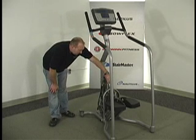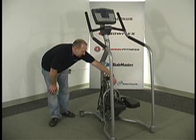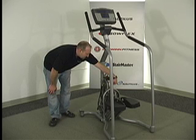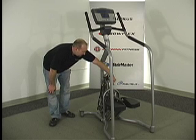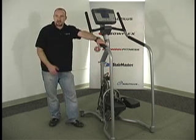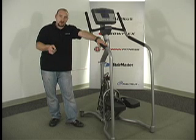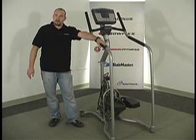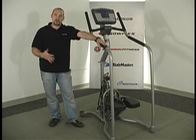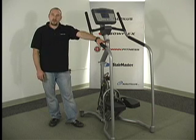The last thing to talk about is your alternator. You can test your alternator by taking off these connections on the back. This one is the B+, which is a white wire, and then we also have the field connection, which is a brown wire. As discussed in previous sections, all you need to do is the B+ to field test. You connect a jumper wire to each end and just start pedaling. It's as simple as that to rule out your alternator. Once you've gone through these components in this order, you should be able to troubleshoot any resistance issue on our steppers.